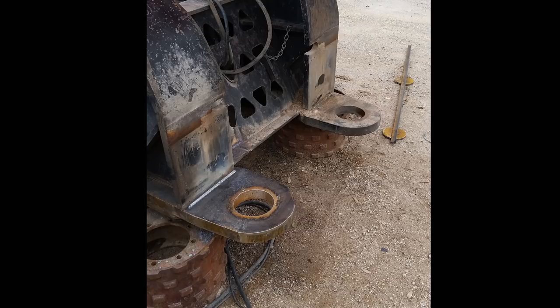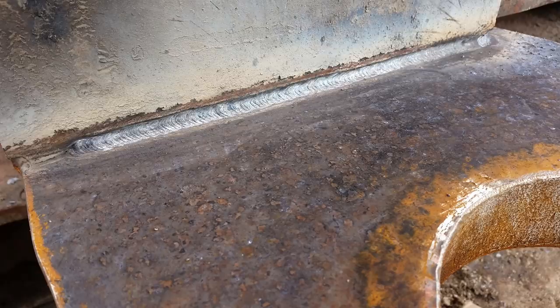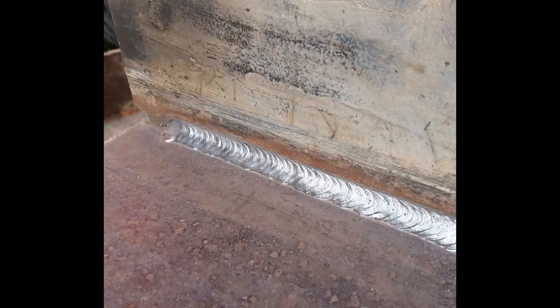So, quite a bit of work, not so bad. A little bit of gouging, a little bit of welding. Customer was super happy, so that turned out well. The weld did not go across the whole length of the front edge of that plate. It was only a two-pass weld. That one and this one. So I left it at that. And of course, all the weld perimeter that goes around the sides and underneath, that held it in there pretty strong. So that worked out well too.